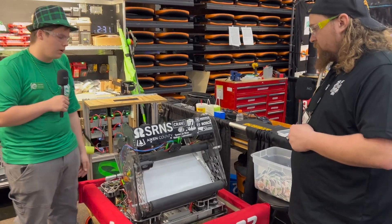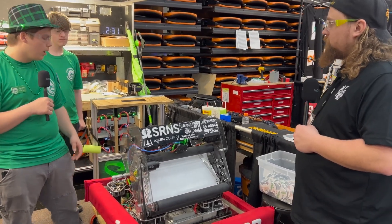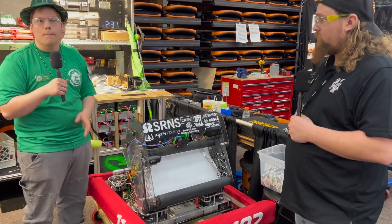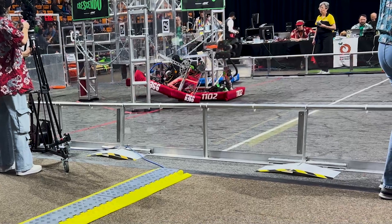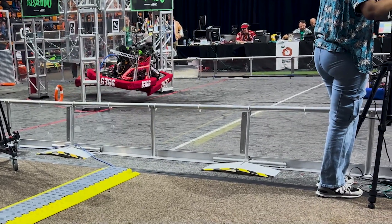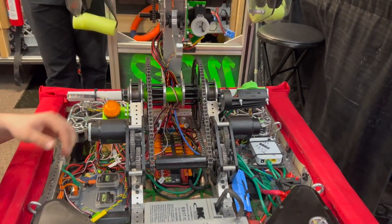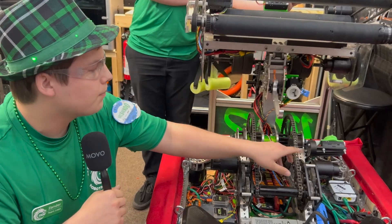The team settled on the telescoping arm because it allows us to get a little more range on shots and some adjustment to our shooting angle along with height that a wrist couldn't really give you. We have a podium shot where we have the angle just right to go over a four-foot-tall defense robot — I can bump up to the podium angle and it'll shoot just barely above that robot, but it makes it. We also added what I call the talon — it's kind of a hook. The gear ratio on our shoulder is a little loose so we fall down when we climb. We added this hook that springs out and grabs onto the shaft connecting our two gearboxes, taking the weight off the gearbox and putting it onto the shaft.